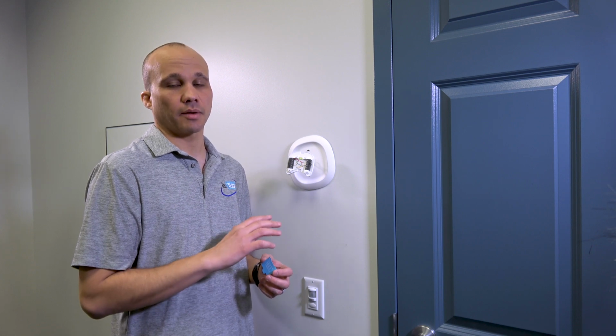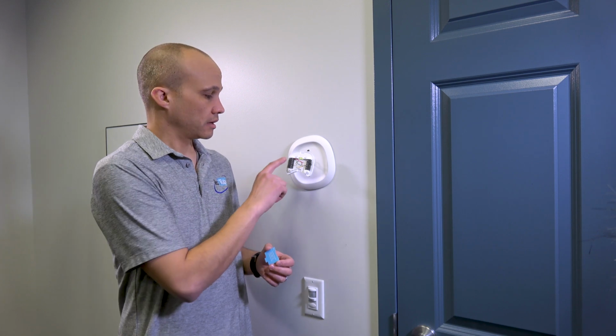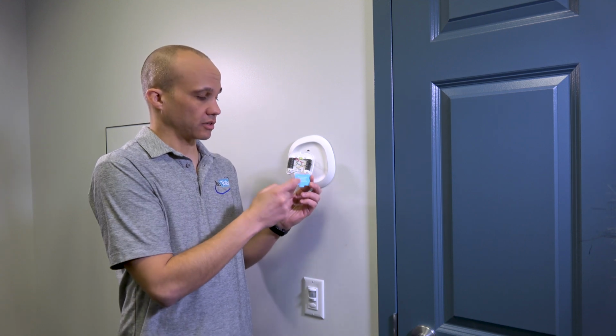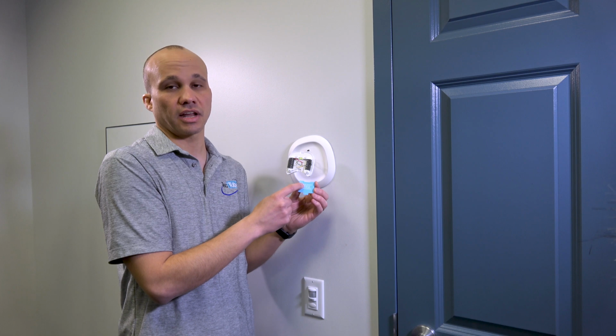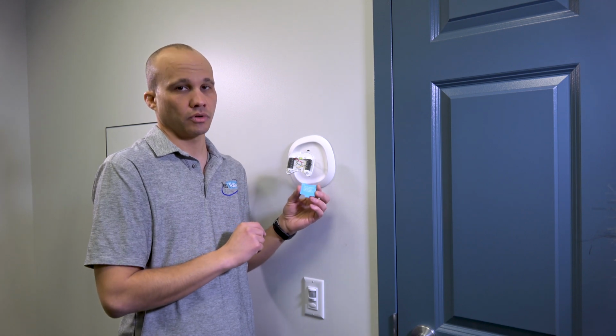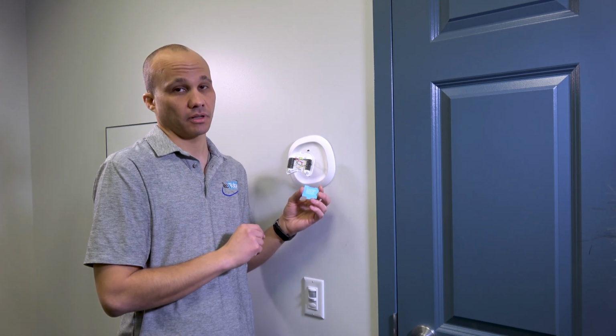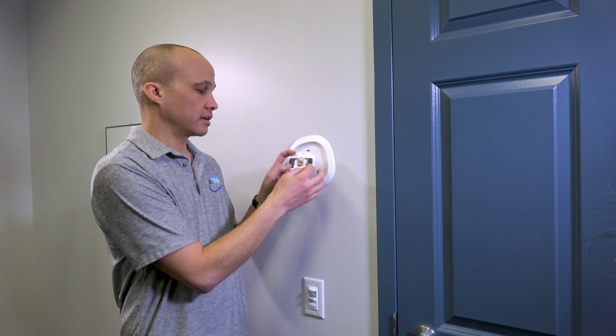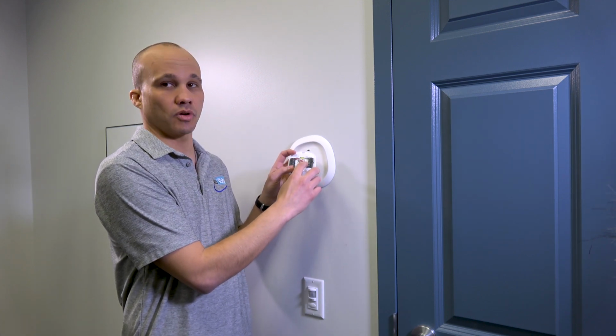So now with our PEK kit installed over at the furnace, we're back upstairs by our thermostat. The red wire is going to go to R, and in the case of the ecobee stat, there's a little tag that comes in the shipping that tells you that if you're only going to have one R, which we do, put it on the RC terminal, not the RH. So we got red on RC, we got heat, the white wire on W1.